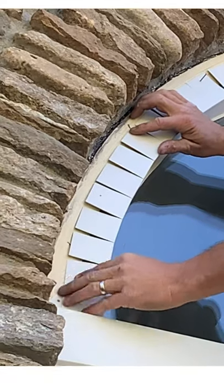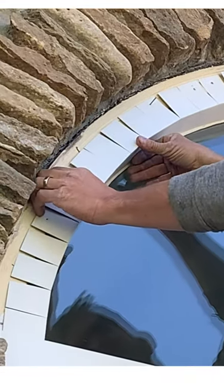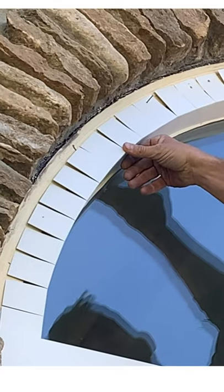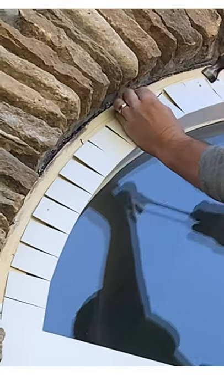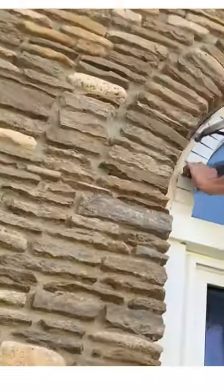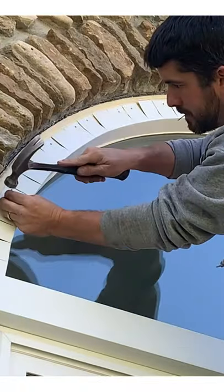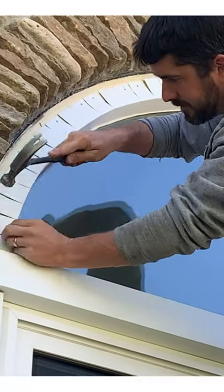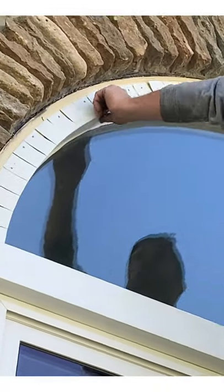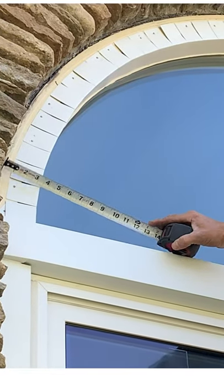So it's sitting a little more natural now. I'm kind of gauged off that line in the brick mold. You don't want that piece that you're folding around — those notches — to go all the way to the brick because you won't be able to seal it as good. When we seal the face over top of this, we want to be able to glue directly to that brick mold.